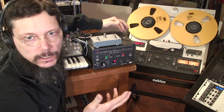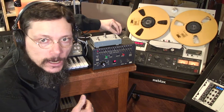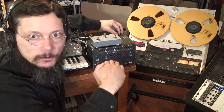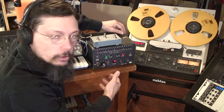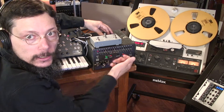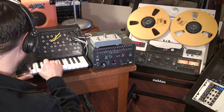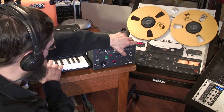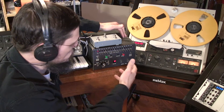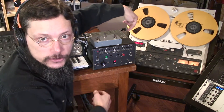It's just a 200 Hz square wave — almost any high transient signal will work. The audio from the clock source on tape goes into the clock input jack on the Model 800, and on the back of the Model 800 there's a level control to set the trigger level for the transient. Once you have a clock signal, the recording process is exactly the same as any other way to record on the Model 800: you enable record and then play in your sequence. As soon as you hit stop record, it goes into playback loop mode. To show that it's synchronized to the tape, I'll vary the speed on the open reel and the Model 800 will speed up as well.